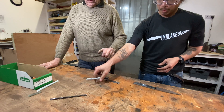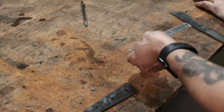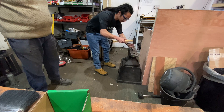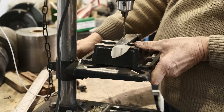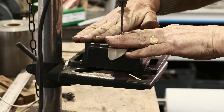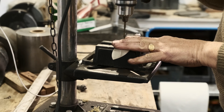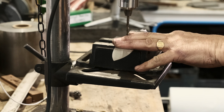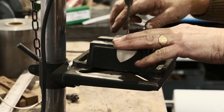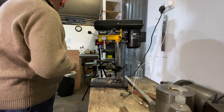Now we go over and we're going to put centre marks in there, so the drill knows where to start drilling. We drill on here using the drill vise, just so it gives us somewhere parallel to put the blade on and hold it flat. So if we enter the hole, and we've done our normalising properly, the drill will go through quite comfortably. That's one, that's two, that's three, and away you go.